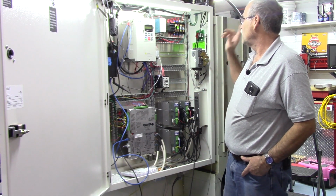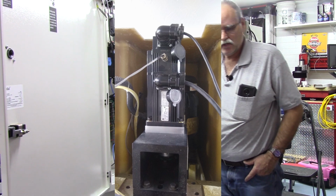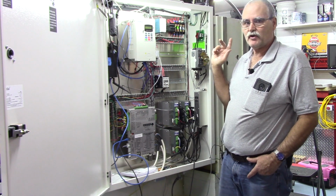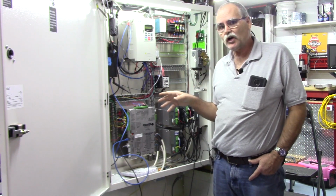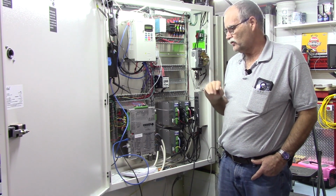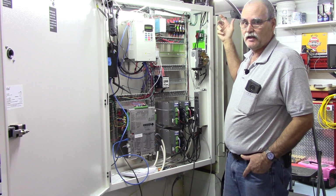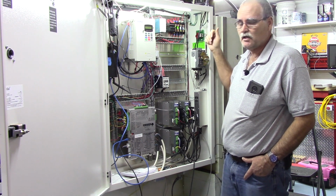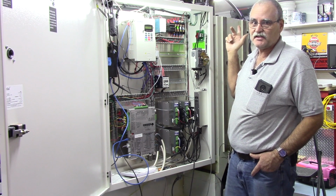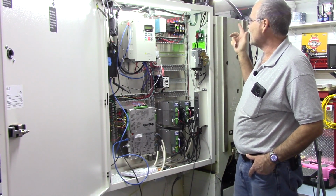Now my Z-axis, I have a brake on the spindle. I'll point you up there a little bit, and it's a DC 24 volt brake. Output 9 on the Oak controls that brake, so until there's any motion called for on the axis, whether you jog an axis, set home, or go in MDI, the brake is not energized. When it's not energized, the axis motor shaft is locked. But as soon as you call for motion, Oak will automatically energize the brake, thus releasing the brake on the Z-axis.